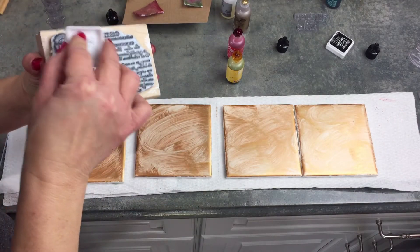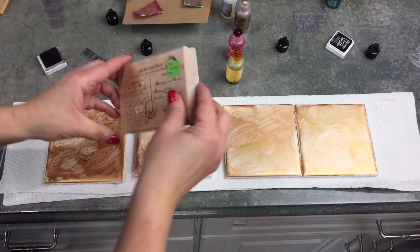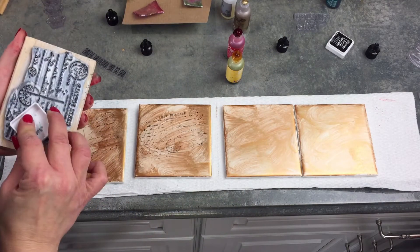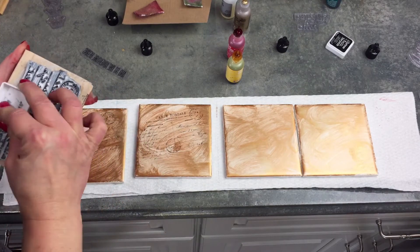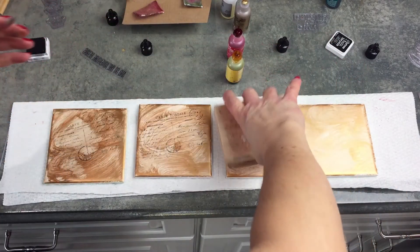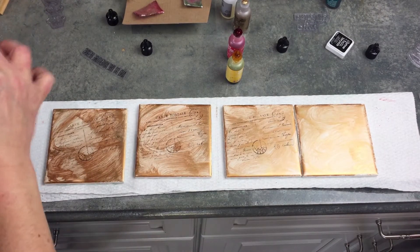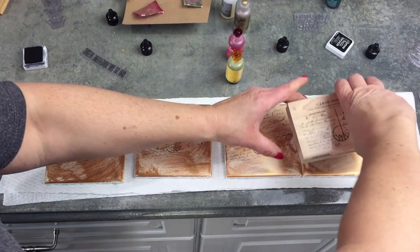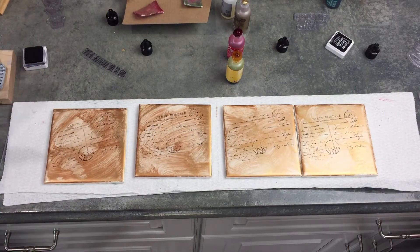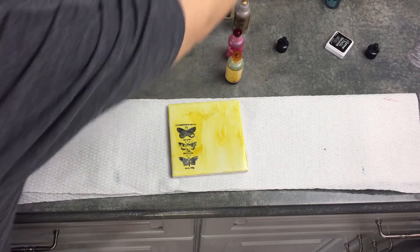It's very easy to rub off a mistake with rubbing alcohol. Numerous people have written in asking whether this non-traditional product will hold up against wet conditions or grease around a sink for a backsplash. I believe that if you sealed it — with mod podge or a sealer designed to go over tile — it would hold up in a wet area like a kitchen or laundry room, though I haven't tested that yet and would need to confirm.